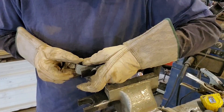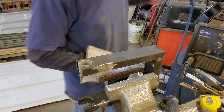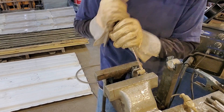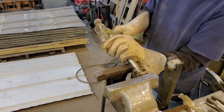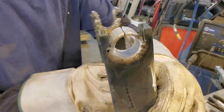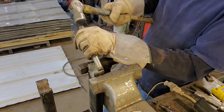I'm gonna put this sucker in here with the crack right on the top, line it up, give her a few tacks. Now we're gonna bend her open — gonna get a giant screwdriver and do some bending. Now we can use the fat boy. Giving it a bit of a taper to the top and do the same with the other side. It'll look prettier after a grinder clean, but for now I'm gonna whack the crap out of this thing.